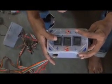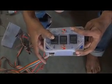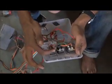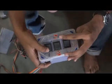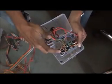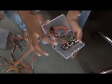So this is the logic behind these toggle switches. You can see these switches. It's off right now. Once you press this, it's going to connect positive to positive, negative to negative. And when you click on the other side, it's going to connect negative to positive and positive to negative. So I will discuss about how this actually works.